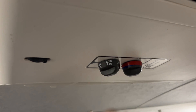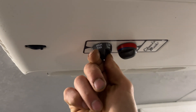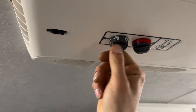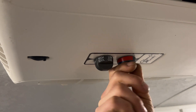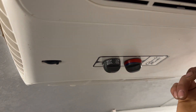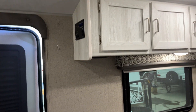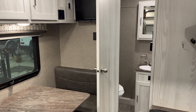Lastly is your air conditioner. You have low fan — that's just the low fan moving some air around. High fan is the high fan moving some air. Low cool is where the compressor will actually cut in and out as needed, giving your target temperature. High cool is the same idea, just using the high fan. You do have the temp selection knob back here; it does have heat on it, but the heat strip is not installed in this air conditioner — we have a dedicated furnace, so just leave that on max cool. And that's it for this unit — if you've got any questions, please feel free to give us a call at 204-237-7272.